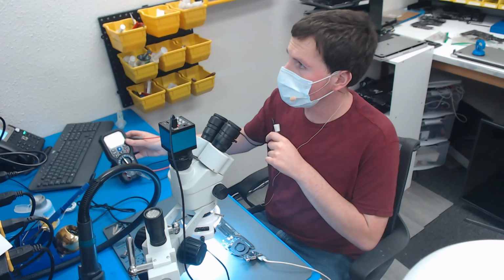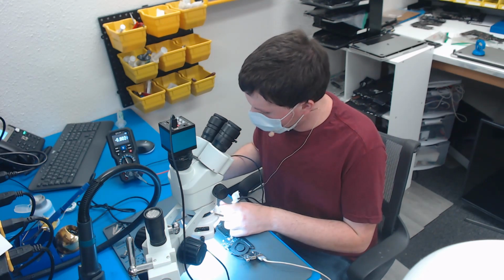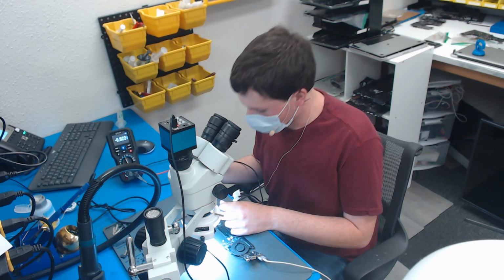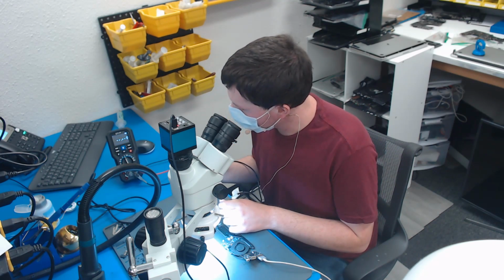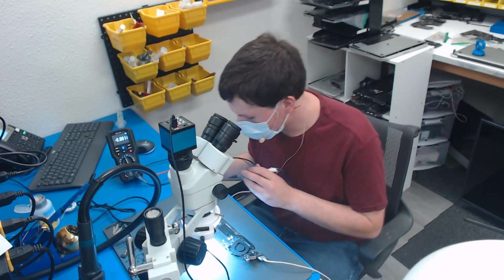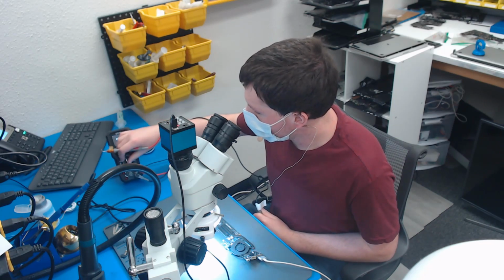I always check the system side of the fuse because that will tell us, one, if the fuse is blown, and two, if the rail is missing. So that's 0 volts, and the other side of the fuse is 8.58 volts. So our fuse actually blew for some reason. So we probably have a short on the system side of PP-Bus G3 hot.